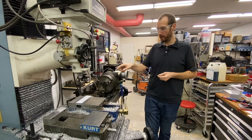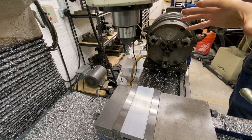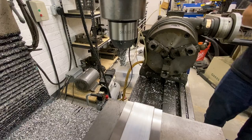I'm going to show you the machining of one of these vise jaws. We've set it up so we can do the holes and pockets with one tool, eliminating all tool changes in this operation. You can just pop in the next part and cut them all with one tool. For a machine that doesn't have a tool changer, that's a pretty easy way to make your operations more efficient, even if you have to adjust speeds or programming a little. We've got a 3/8-inch rougher-finisher in here that allows us to go full depth and pocket it out as needed.